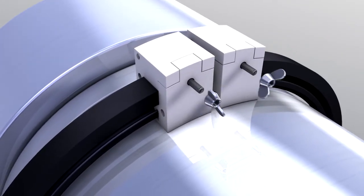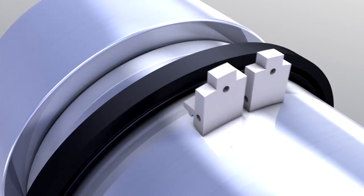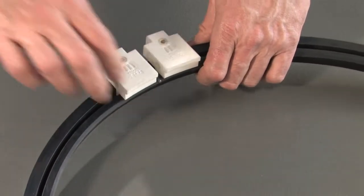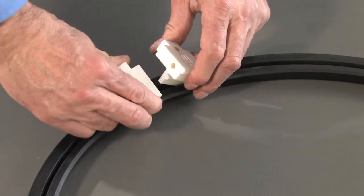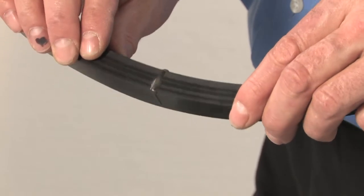In case such a gap is noticed during heating, try to fill this gap with the rest of the bonding agent. About 10 to 15 minutes after the recommended setting time, you can remove the bonding device. If the joint has not bonded firmly, perform the bonding procedure a second time.